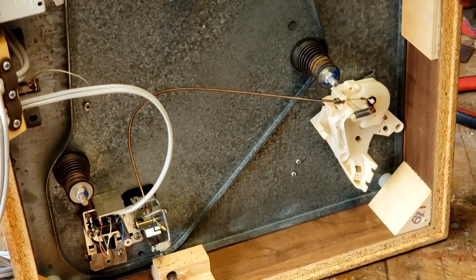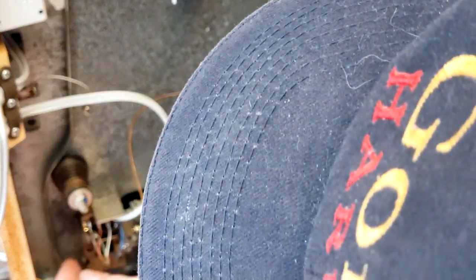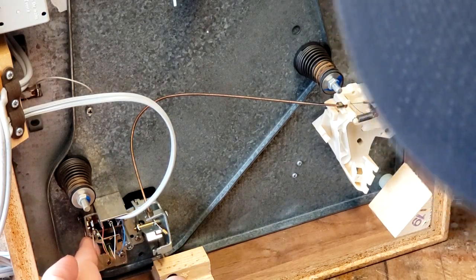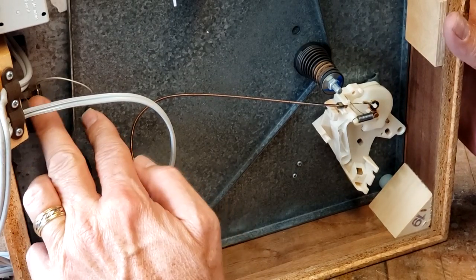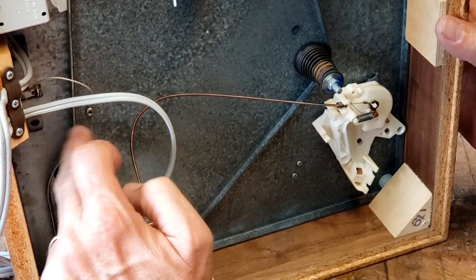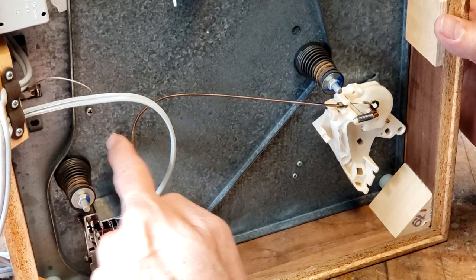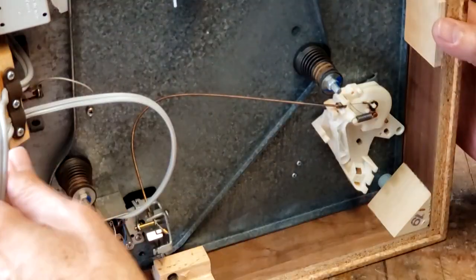So what I'm going to do is flash up my soldering gun here, let it warm up, and then we're going to pull these things off. The ground wire here for the arm itself, which is this clear colored guy off the bottom of the wand, actually goes to the right ground, which is consistent with these turntables being right grounded turntables. And then you have a chassis ground strap here that goes from the floating chassis to the fixed chassis, and that grounds these two together, and this grounds basically the arm itself, I believe, to the floating chassis. So yeah, she's a nice little turntable.